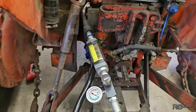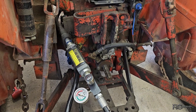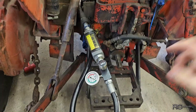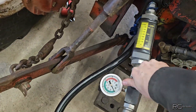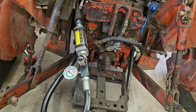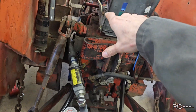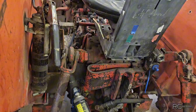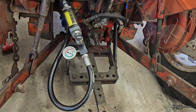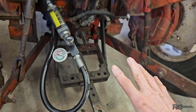I needed to come up with a test for this, and I like doing things the simple easy way. So I just waited till the next day, let the hydraulics all cool off again, started the tractor cold, tightened my tap right down to put this into stall pressure, engaged the SCV and left it engaged. Right up to 2200 psi — made good pressure, you could hear the relief valve opening, it was squealing away, and then all of a sudden it stopped squealing and our pressure just went down down down. I left it like that for about a minute, minute and a half.